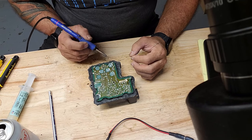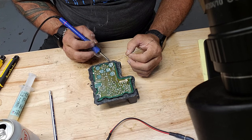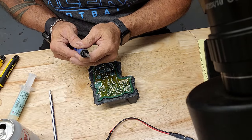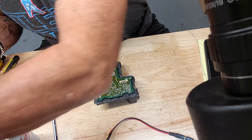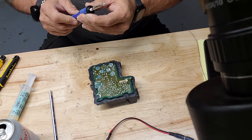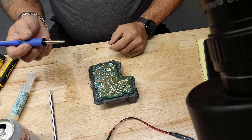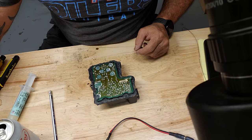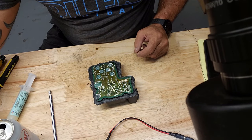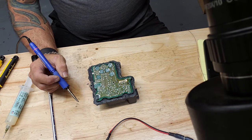If you're having trouble soldering, most of the time the answer is more flux. And in this case, this little tiny iron tip that I have is not the one to go with. Something more substantial like that. Come on, heat up.